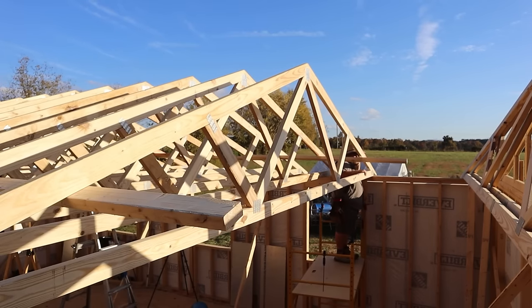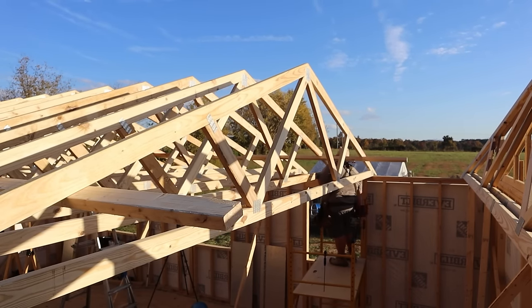Two work days and all of the roof trusses are in place. It looks really weird actually — there's a whole web of two by fours up there, and somehow magically they span 20 feet wide. Even though there's a joint in the middle, they're held together by these little flimsy nail plate things — it's magic I guess, but it is done for the trusses. I still need to build out my roof ladder rakes on this end of the workshop, but I'm going to do that tomorrow.